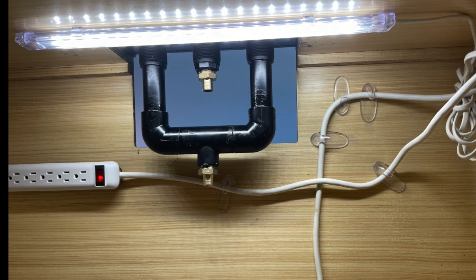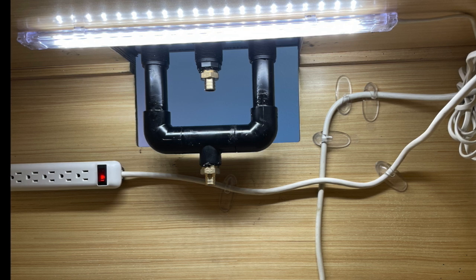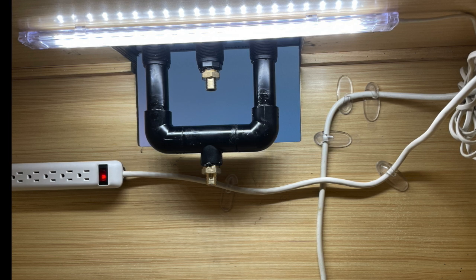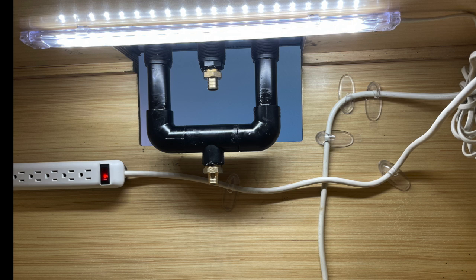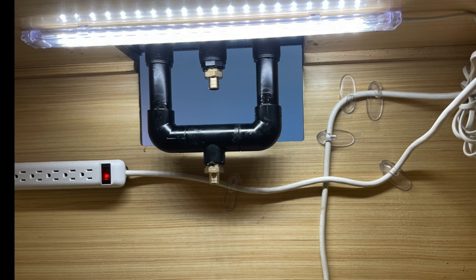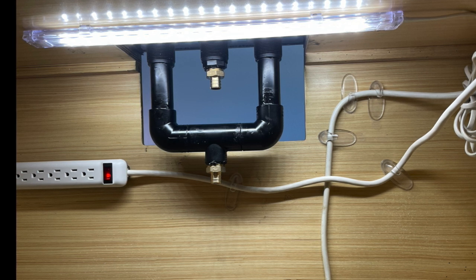But each bulkhead was already pre-fitted, and as you see, you have the brass there for the 5/8 or 16 millimeter tubing. And when you install brass and you're using plastic or PVC, this is 40 PVC, not the 80, but it's a 40. If you go in there with the brass just dry onto the PVC, you're only going to be able to go so far because it's a pipe fitting, so it's tapered. So what I do is I put some silicone on it, and then I go in there and start tightening it up.